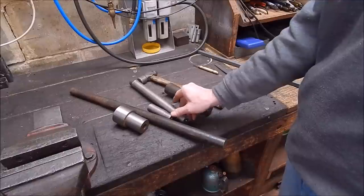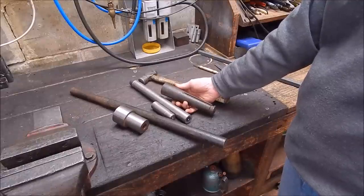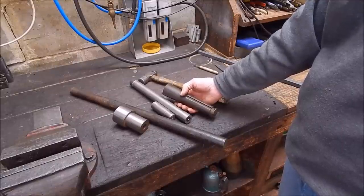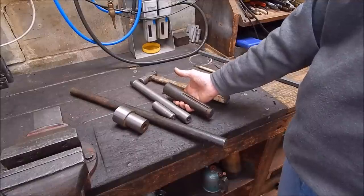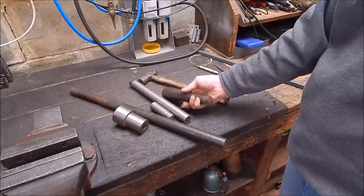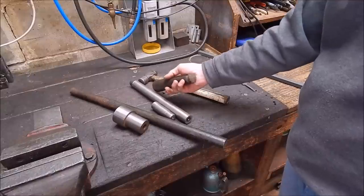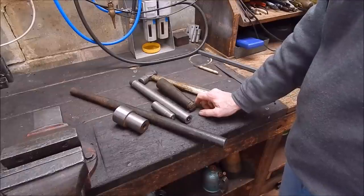Watch out for old steel — like this hundred-year-old stud axle off an old ox cart. This steel can be really nasty because the chemical composition wasn't very controlled back then; they didn't have the scientific skills to properly formulate it. A lot of it is hammer-forged and will have compression lines and fold-over lines. I've seen work done with this stuff where it got fatigue cracks in a very short time — it's just not very good. Anyway, steels aren't all equal, but when you get them for nothing, they're a steal! See you next time, cheers.